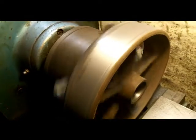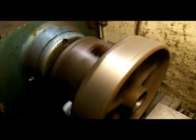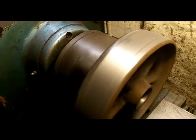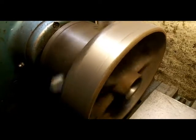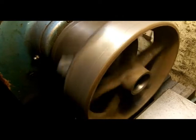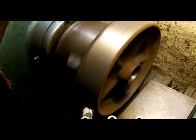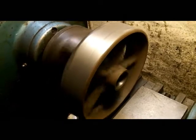Just a tip here: if you're actually cutting cast iron on a lathe, you want the feed slow so it gets a chance to cut into the layer. If it's too fast, I believe it forms a hardened surface and just blunts the tools. I think I've got this at about 85 RPM — just a wee tip if you're going to be turning cast iron.